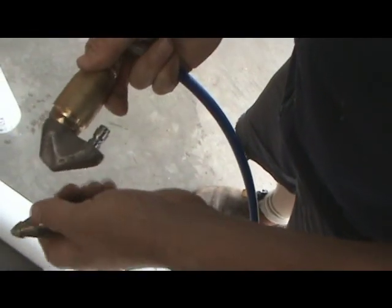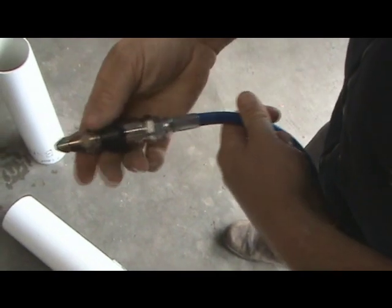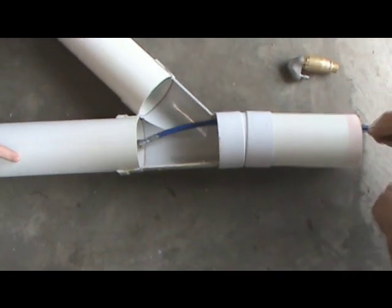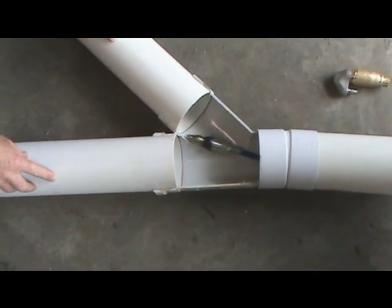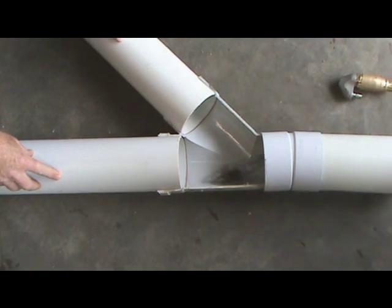Here are the hazards of going through a junction. Past the junction, put on a root rat nozzle. When it goes up a line, it'll quite happily go straight ahead. See there's a slight kink in the hose - there's always a bit of a kink in the hose. If you're clever, you'll get it going up here. Once it's under pressure, it'll pull itself straight and go straight up - it'll miss that junction.